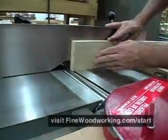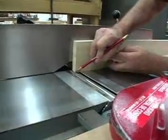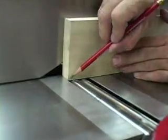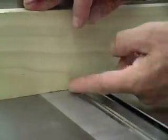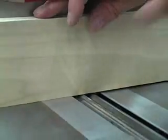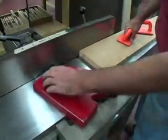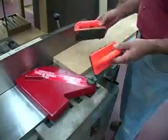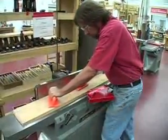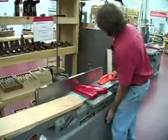As you're coming in, the knife is cutting a scoop away from the board. As the board goes across, this surface references the outfeed table, and as long as you're pushing down, the knife is straightening that whole face — or in this case, an edge. It's essential that all of your pressure is on the outfeed table as soon as possible. I'm also using push sticks whenever I'm face jointing. On a jointer like that, I would never run anything shorter than 10 or 12 inches long. If your hand is getting anywhere near the blade, you just have to do it by hand — and hand planes do a great job.